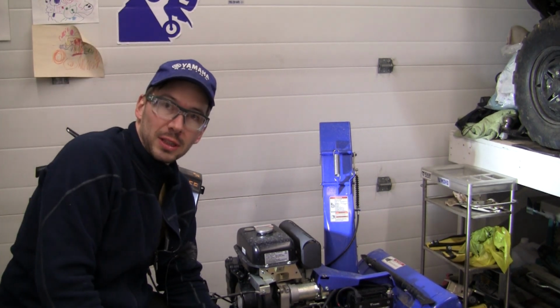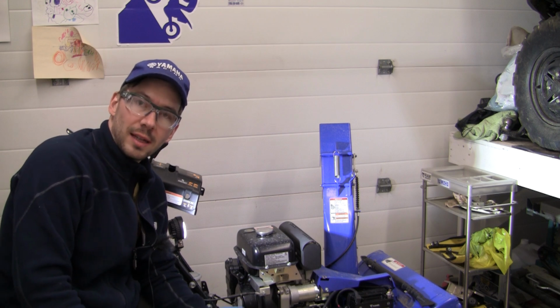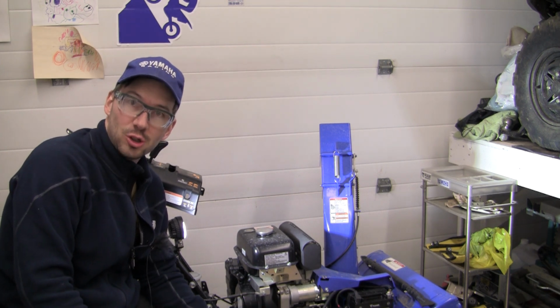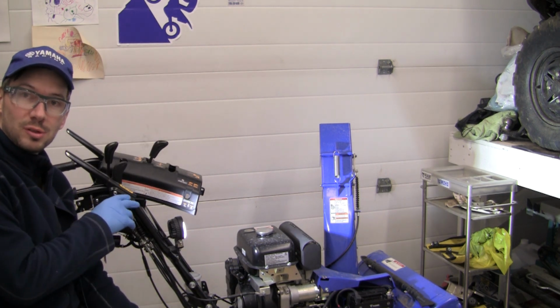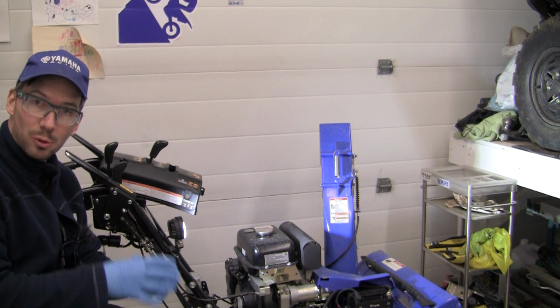All right, so we're going to do a quick demonstration of how this overvoltage protection device works. So I'm going to open the door, I'll pull the fuse, the light will turn off, I'll manually start the blower, and you'll see how the light behaves for about 1.5 seconds, 2 seconds, then it should turn off, meaning the fuse is popped. Now, this is a prototype version, so the fuse, not that it's hard to access, but it's not hanging down, which would be kind of a next design revision. I'd look to maybe do that, have more distance on it.